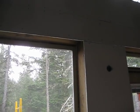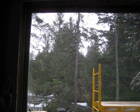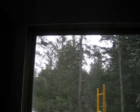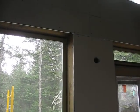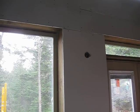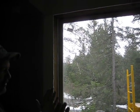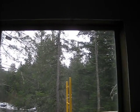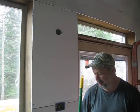I had to do that in the kitchen in one place because it was a big gap, because we made our bucking big enough to accommodate to make sure that they would fit. It creates a little bit of a finish issue, but if you know what you're doing, you just shim them out and get them straight. If you don't get them perfectly straight, you can fix it with mud. You can just pack the mud in them, which you have to do anyway when you do bullnose.